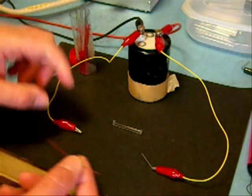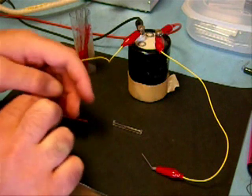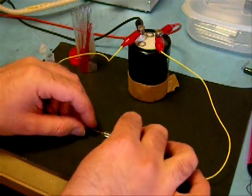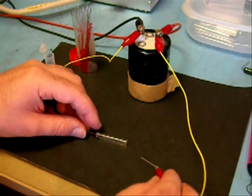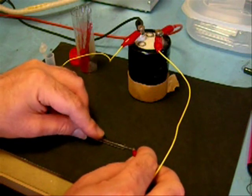This is a crude setup for flash welding the wires. The seals are made using dumet wire, but this needs to transition inside the glass to nickel iron wire to support the electrodes. A short length of capillary tube is used to make the wires meet end on.